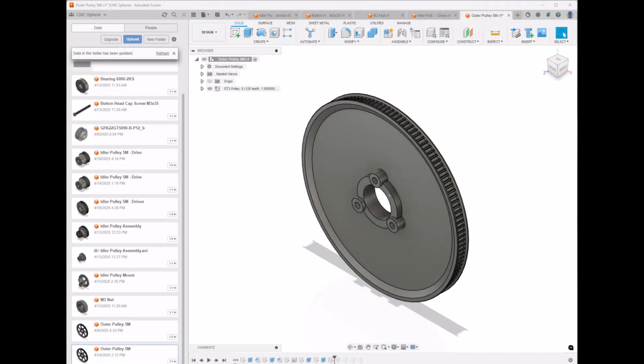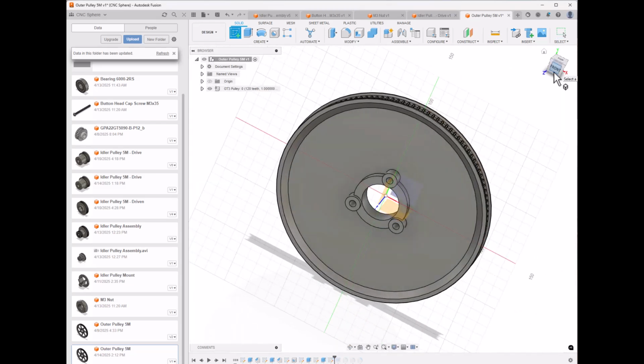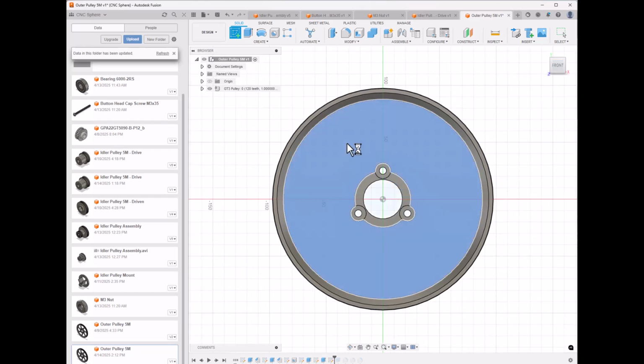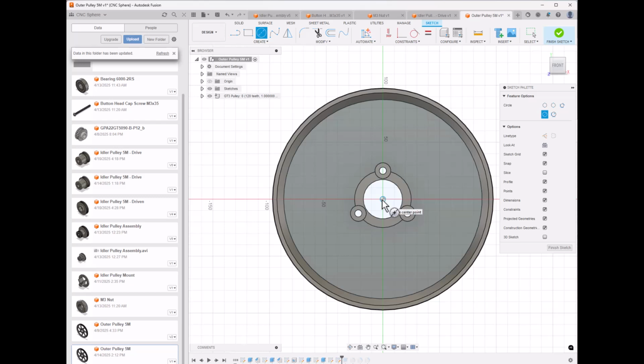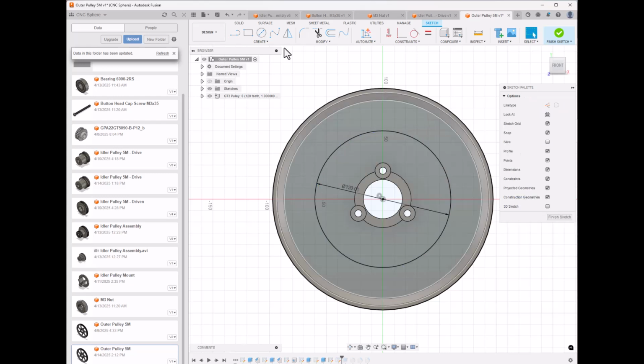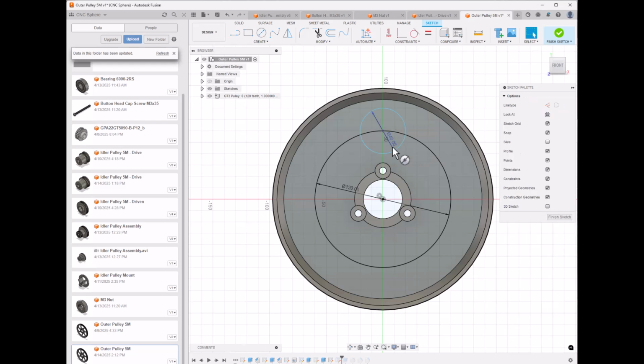A YouTube subscriber asked for more detail about how I made the cutouts on the large pulley. So let's start there. We're going to create a 100 reference circle, and a 120. And then from there, what I did was I put a single circle here of 40. And this is what I started out with.